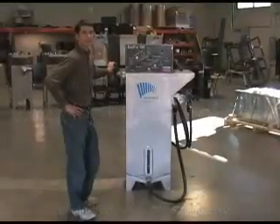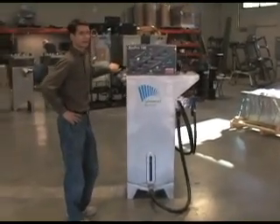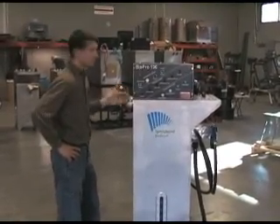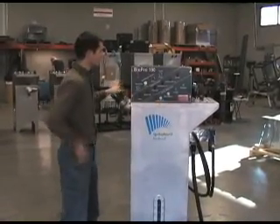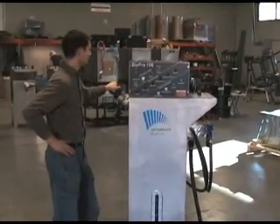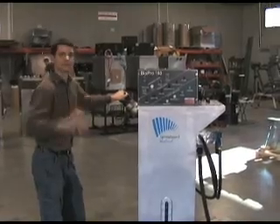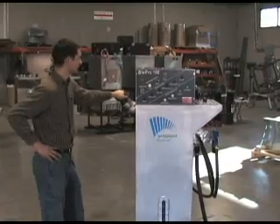What you don't see right away when you look at this machine is the internal componentry. Great care was taken to have that be as safe as absolutely possible. Take the main stirring motor, for instance — it's an explosion-proof motor. It's a C-face on the motor which allows it to seal directly to the surface of the machine, and then there's an internal mixing prop that agitates the fluid mixture. The same type of setup is used for the methoxide mixing chamber: an explosion-proof motor with a sealed face on it directly, that stirs a prop which agitates the methoxide mixture.